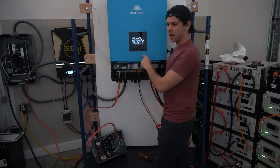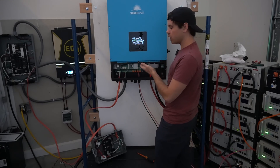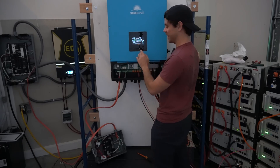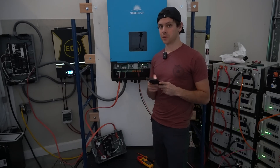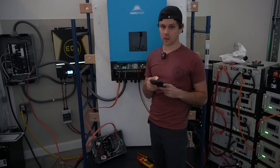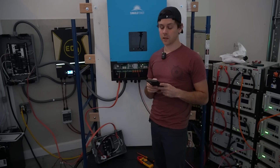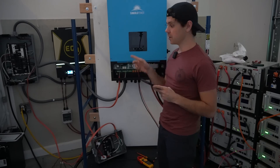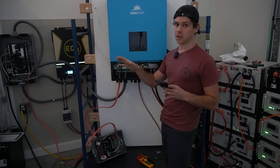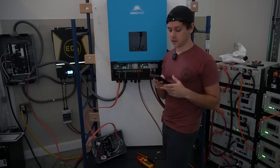I can't seem to access the settings menu — it won't let me. This product is so capable, they just need better software. You have to press back and then the two arrows — they need to change that. We need to think about the ground-neutral bond in bypass mode because right now it's going right through there. There is a bond at the main panel on the other side of the house and also a bond at the AC output — so we have a massive ground loop right here. Think about that when doing the installation, especially if you have multiple of these in parallel.